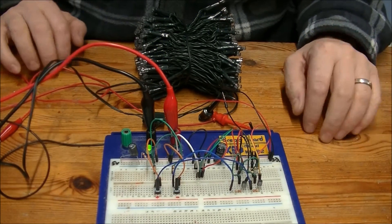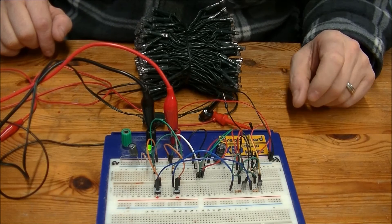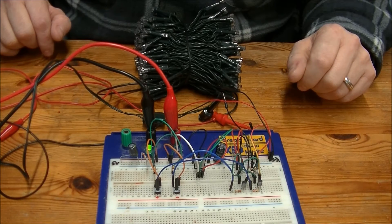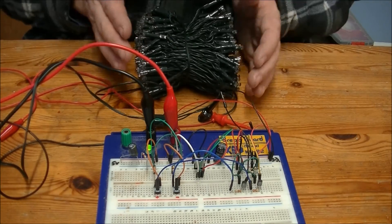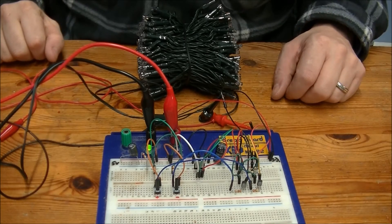The H-bridge circuit — you can buy a chip just to do all that in one. I did find one on Farnell which can go up to about 36 volts max in a smaller package and can take up to half an amp. These are only drawing 100 milliamps a side, so it's an 8-pin package — it'll be a lot easier to do. Check out the next video for connecting the microcontroller, where we'll use pulse width modulation to have both sides on at the same time. With an H-bridge you can only have one side on or the other — you can't have both on simultaneously, otherwise things go bang. Join me in the next video.